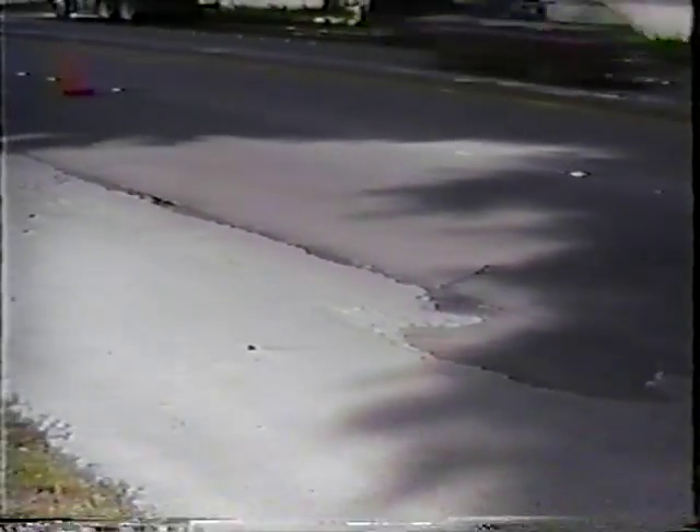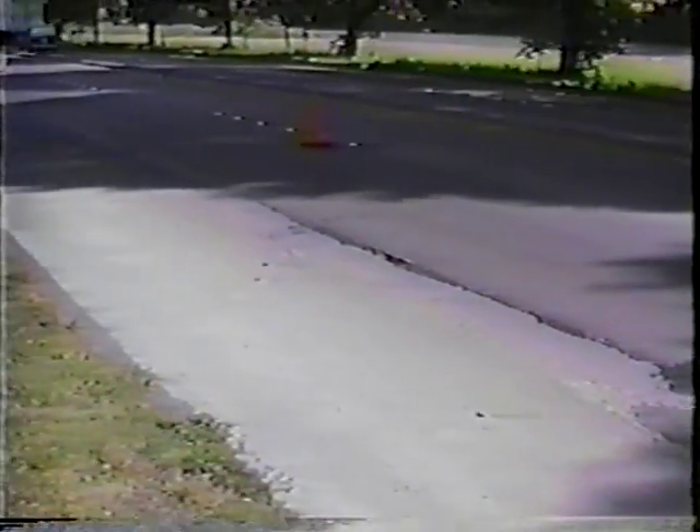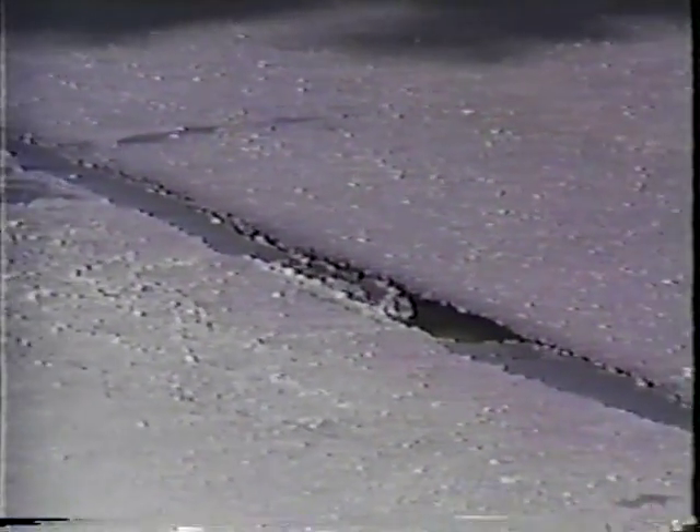You can come in on a road like this and you see how the flaw is localized in one lane. You could remove all of your AC out of that one lane and then take your small cold planer and deal with just the flawed area and actually rebase that. You could cut it further on down maybe six to eight inches and rebase that using your grinding material and then pave back your inlay to match your surrounding lanes.